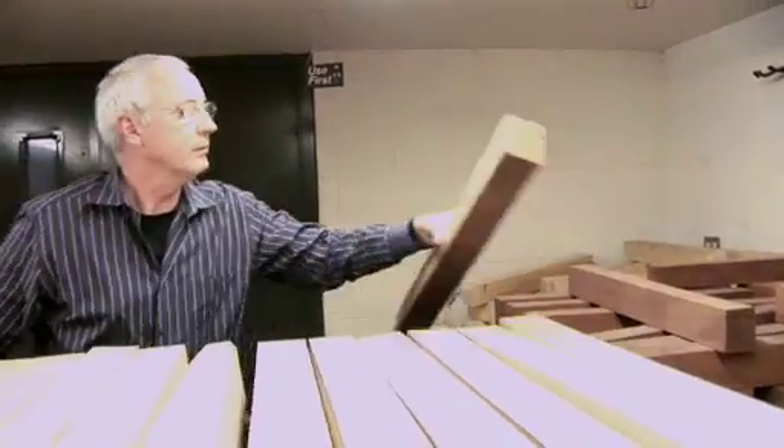We're in one of our sophisticated neck drying rooms for the raw wood to make it sound good. If I take a neck blank from right over here, just one sitting there, it almost sounds like a musical instrument just in this raw piece of wood. Part of what makes a PRS guitar a stable instrument is the amount of time that we take in the process. You can't really just get a neck blank, start hacking away on it, and have a guitar that's going to stay in tune, remain in intonation, and not need truss rod adjustments every five or ten minutes.